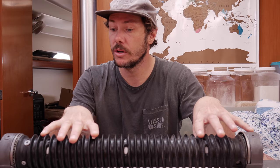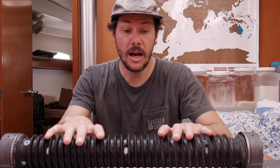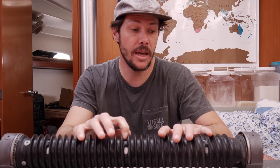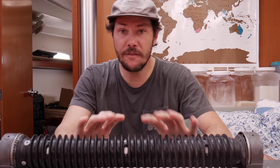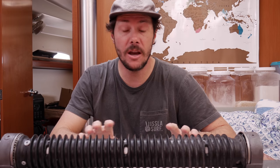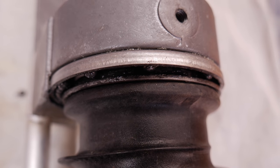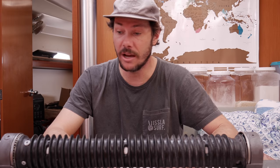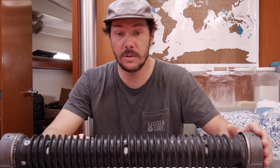I'm not sure how we're going to move forward with this system. If I'm being truthful, I'm losing a lot of confidence in it. Z-Spars is being amazing. Their customer service is fantastic, and they're right on it. But I'm definitely losing confidence in this system. When it's working, it works perfectly. We never get any jams. It furls in and out absolutely perfectly, and I couldn't be happier with it. We love the system. It's such a shame that something so simple as using a non-sealed bearing is the bane of our existence at the moment, and really the main thing that's letting us down with this system. So stay tuned, it's an ongoing issue. I'm waiting to hear back from FKG and Z-Spars on what we're going to do about this, and we'll keep you guys updated on what happens.